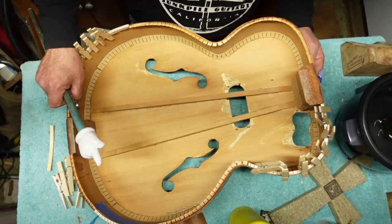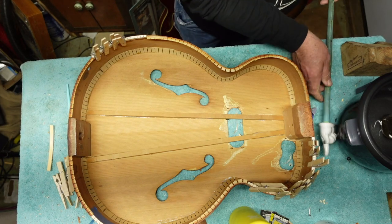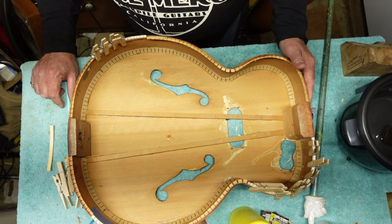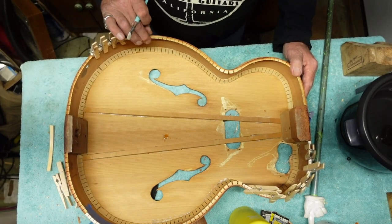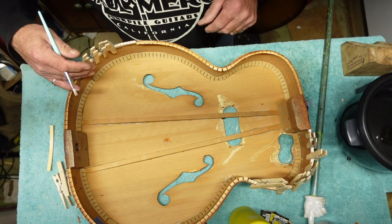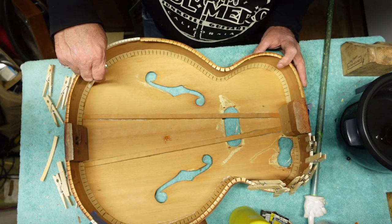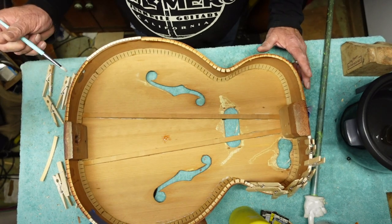Moving along — when we take off all these clothespins I'm going to want to put hide glue on here and it's hot. European hide glue — violin makers' hide glue — and I am going to take a brush and take that hide glue and go everywhere that there could be a problem. Right here it's a little loose — I might actually take a syringe, the botox for hide glue, and clamp that down. We're going to make sure that everything is level and we are going to put hide glue — another coat everywhere on this thing: tone bars, tail block, head block, all the kerfing.